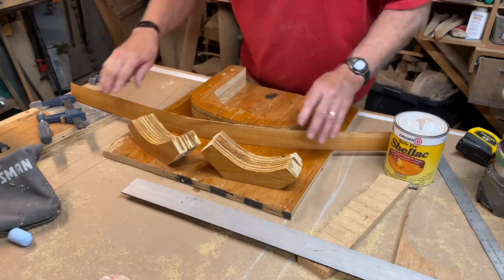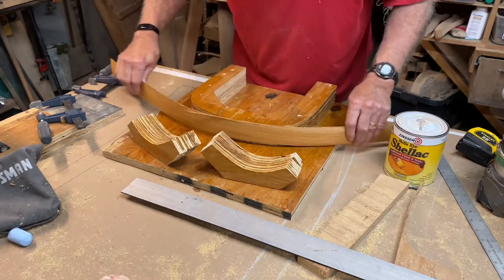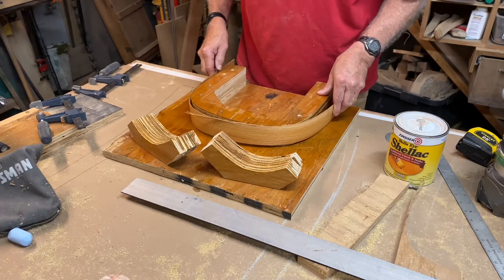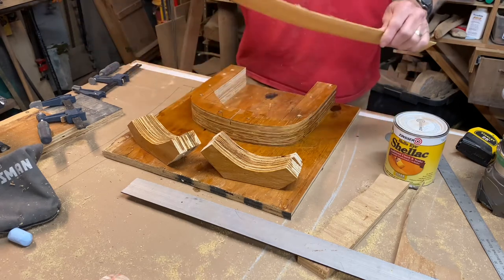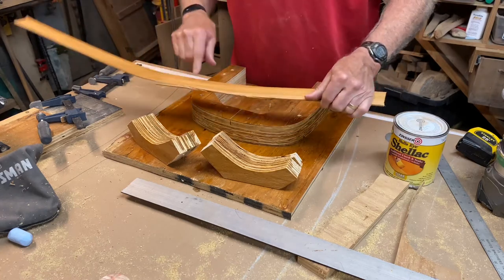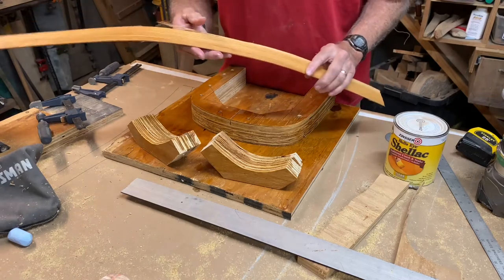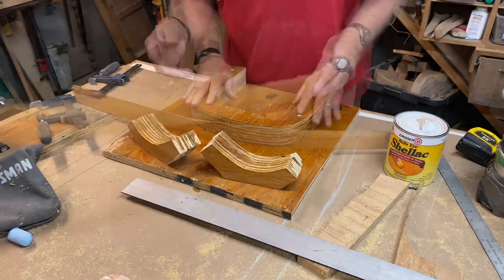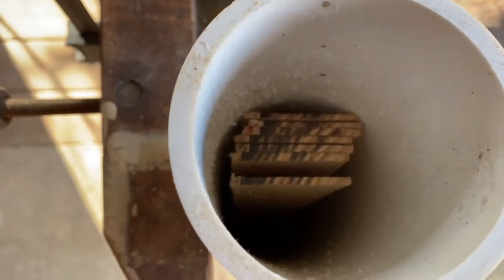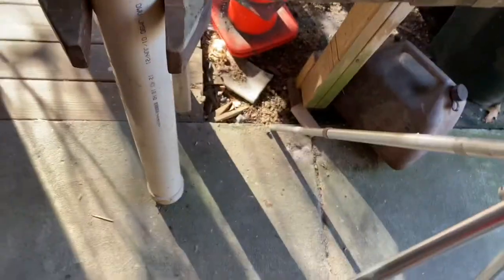Well this is exciting — it's only been soaking a little bit, the shellac is just barely dry, but I've got it around the curve and it didn't crack. This crack was already in there. So next I'm going to cut the lengths and widths the same size — I am not going to plane them or sand them. I have a three-inch PVC pipe and five pieces in there; I only intend to use four of them. I have two extra pieces just in case of breakage.